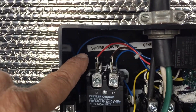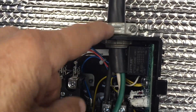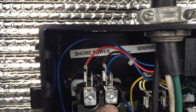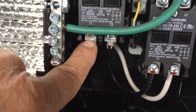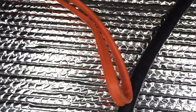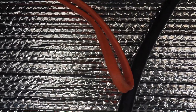That loop I need to cut and run into here. You can see in the back there's the shore power — the two come in, and the inverter comes in on this side. It is actually labeled as a generator, but this is set up for a generator or an inverter. It comes out of the bottom on this side for the power that goes back into the breaker box.